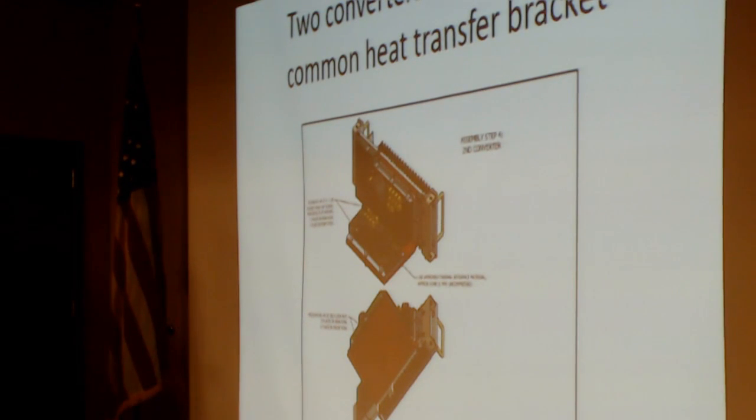We could get away with this because we know that on these particular modules, which are the ones that supply the D710, it does not have 100% duty cycle. So you know it's going to operate for some period of time, and then it'll be off. All this stuff has thermal inertia. I did a fair amount of mathematical analysis, messing around with this stuff initially, and it looked like, yes, we could get away with this sort of thing. But anytime you think, well, is this going to work? We probably ought to try it.